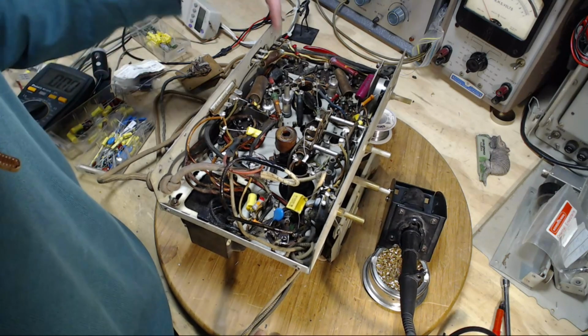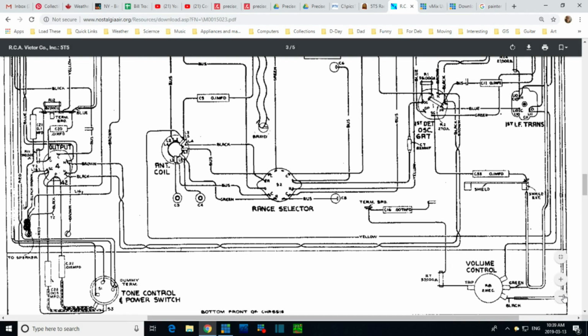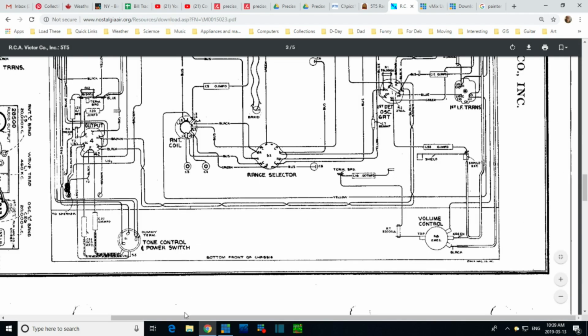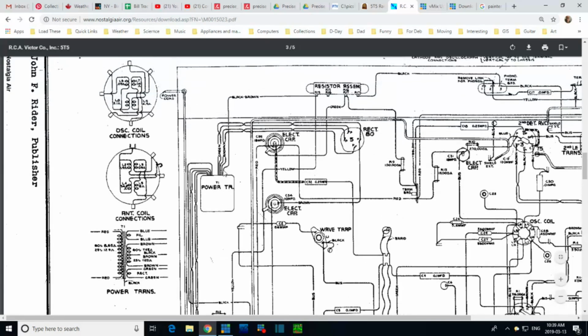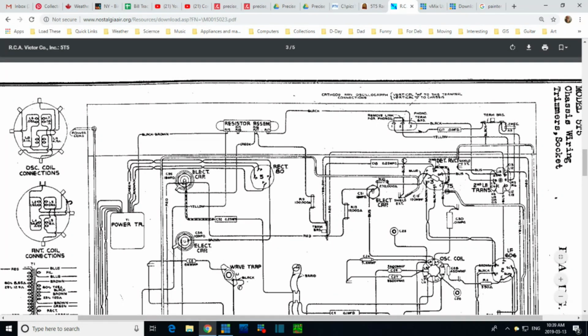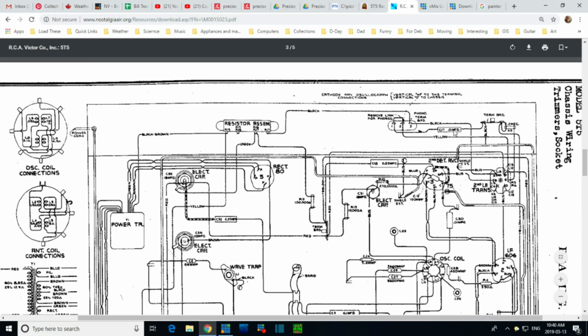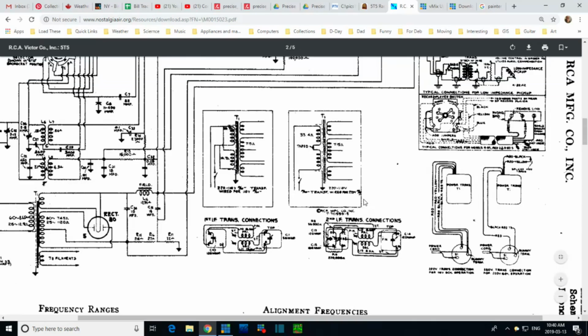Let's find him. Let's find this guy on the schematic. Take a look. Okay, so if we look for the terminals on the back panel here, here they are, right here. So this is the capacitor right there. It shows it going between a terminal. Yeah, it does that. It's a terminal strip there. So this is at 0.01, and you remove the link, C17.